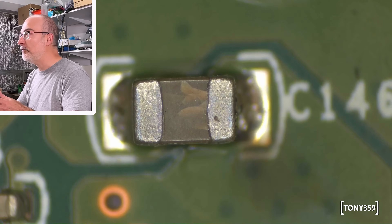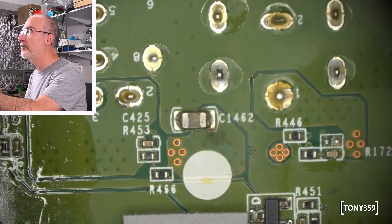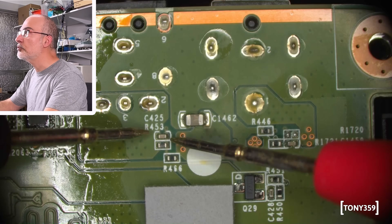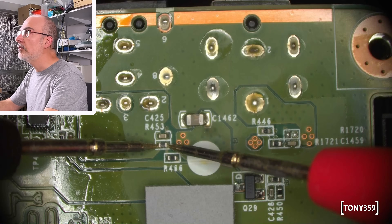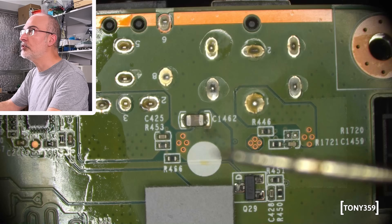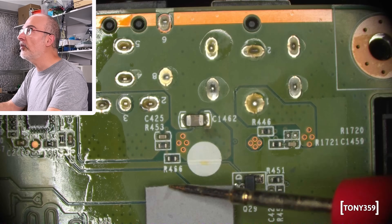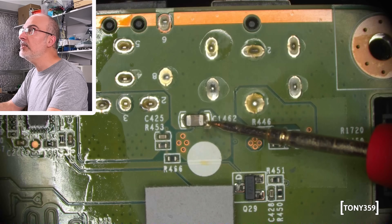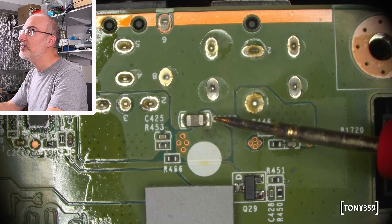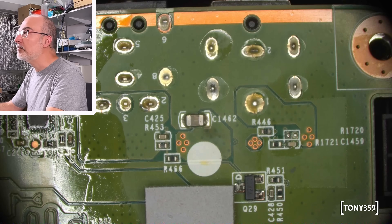Obviously if I check for shorts I have shorts all over the board, because I have a short on this capacitor here, and also I guess I have a short here, and also a short here. Everything on that circuit is going to be shorted. The fun thing is to find the actual shorted component. Shall we inject some voltage, or shall we just move this capacitor away and see if that's the one? I mean, it looks so broken — that to me is the problem.